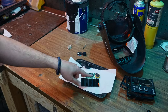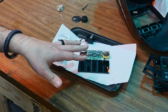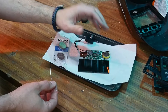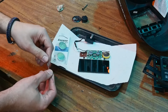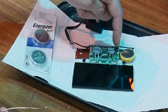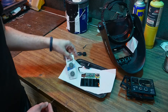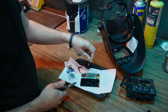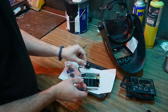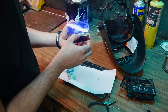As for how I'm thinking about connecting it - I've seen people solder leads on YouTube, but they warned you could blow it up. So I'm going to try MacGyvering my own method: putting a piece of conductive wire, looping it around, making it very flat on the surface, then coating the entire thing in hot glue to insulate it and connect the wire leads to the board. For about six bucks I'll hopefully have my welding mask working again.